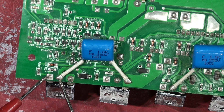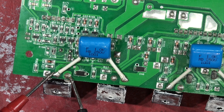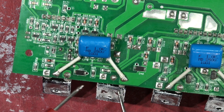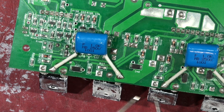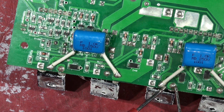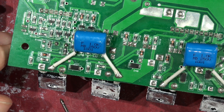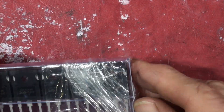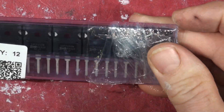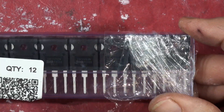So that's the gate, source, and drain — it's all connected together. On the others, there are no shorts. So just out of curiosity, have I got any IRFP250Ns? I've been to the cupboard of plenty and we have a tube of these things in stock, which is good.